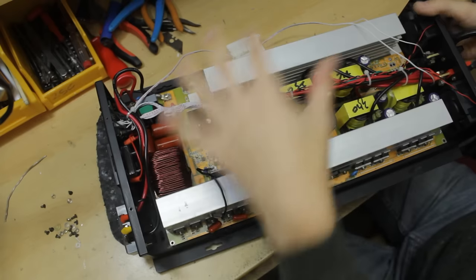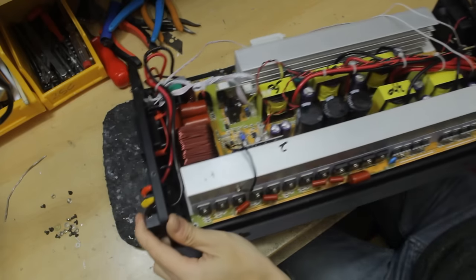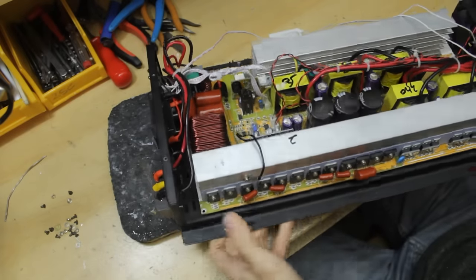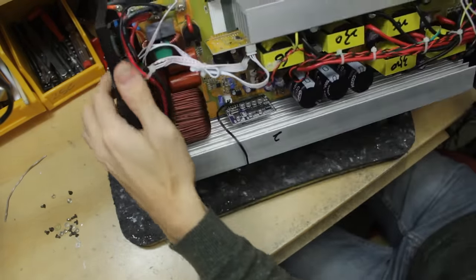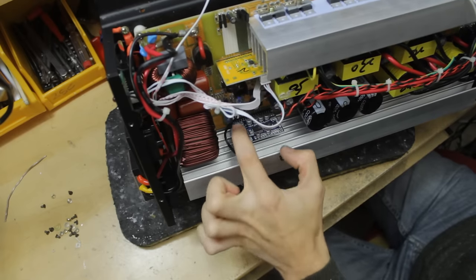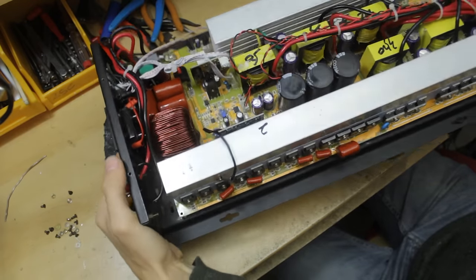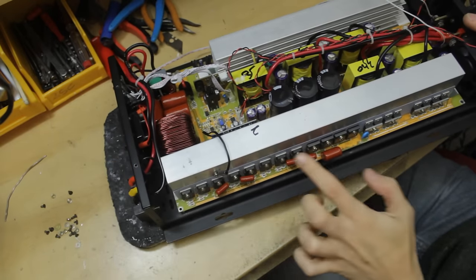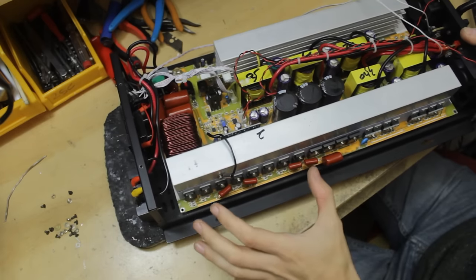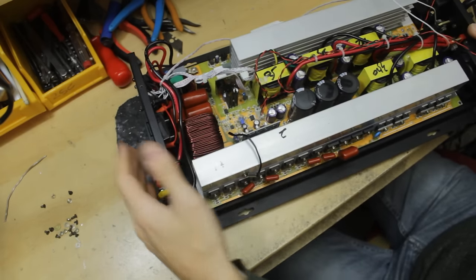If we are driving those and we are generating our high voltage rails, then we could have an output side fault here, either with the sine wave inverter itself, or the crystal oscillator might have failed, although that's incredibly rare, that barely ever happens. We could have some kind of drive circuit fault around the output side. That just means that we're not getting any switching on the high voltage side, meaning we're not generating our output 50 hertz sine wave for the mains plug.